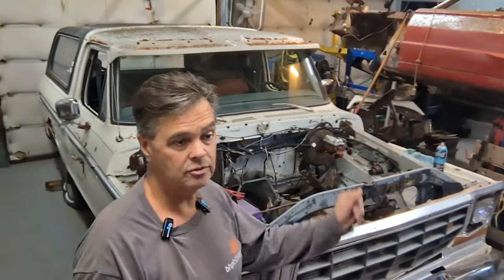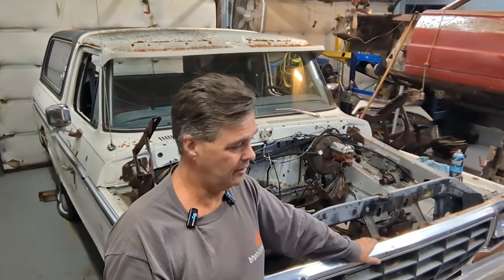I had to keep moving the winch back and forth because I had a 3-to-1 reduction on the cable. My winch is only 2,000 pounds so I had to do a reduction on it — no big deal. It's slower, but it works. Very little labor on the winch.